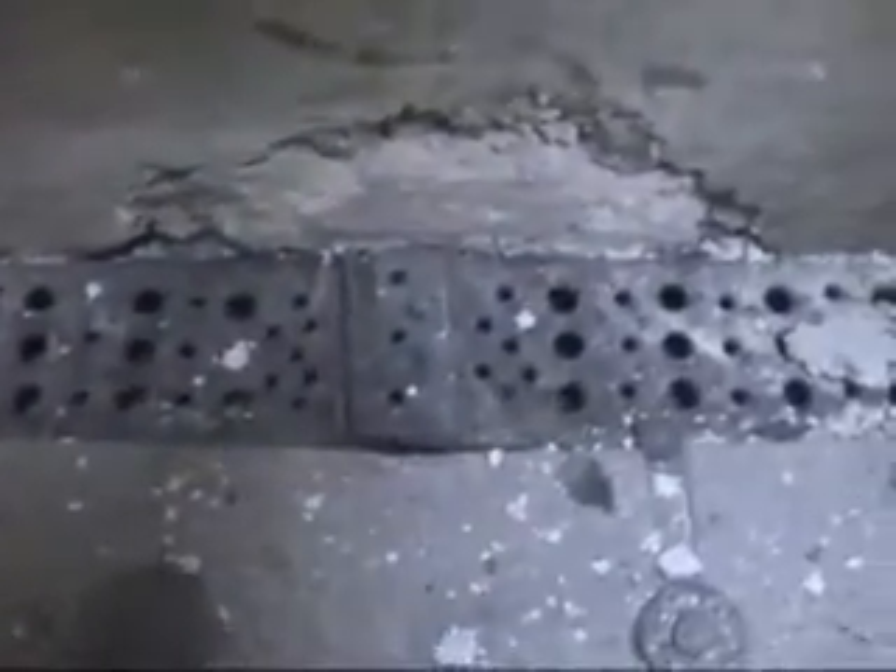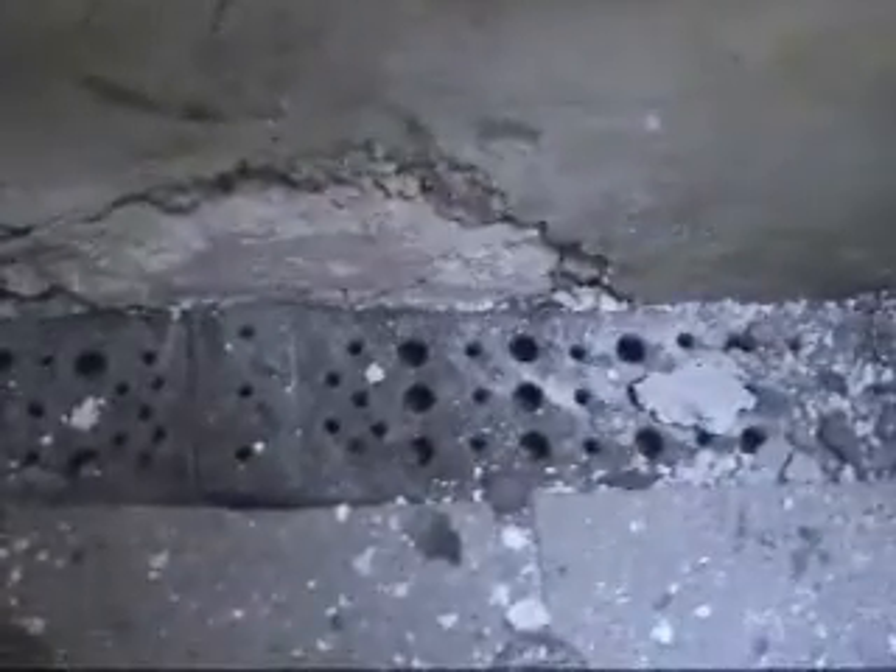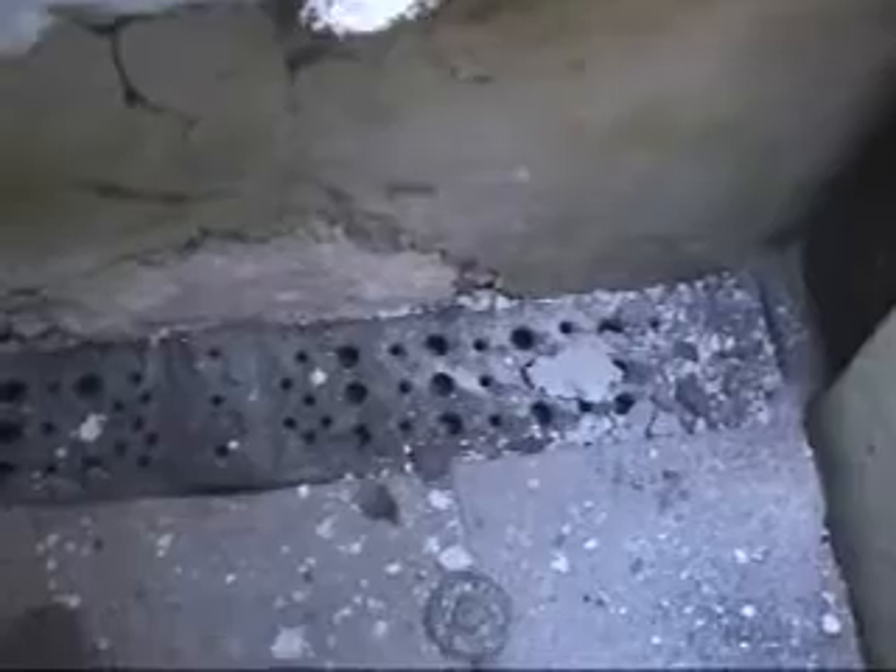In the center right there was where I had a third tube. What was happening was with the tube getting red hot and then cooling off — cycling — I was getting shrinkage. It was pulling the center of that pipe towards the hearth area. So I eventually cut it out and tried this with a single tube, but I'm going to go back to a triple tube again when I rework it.